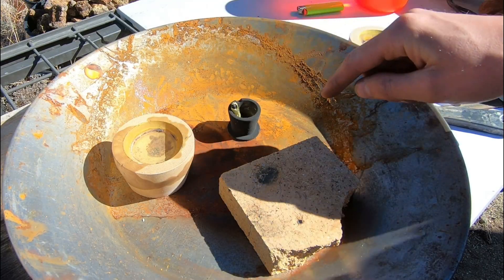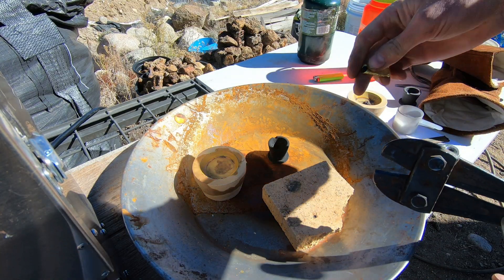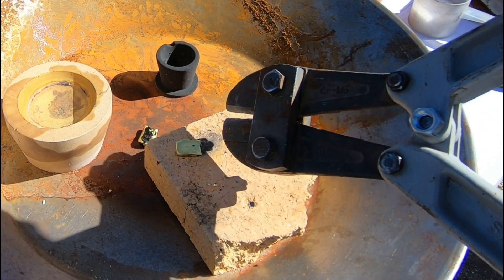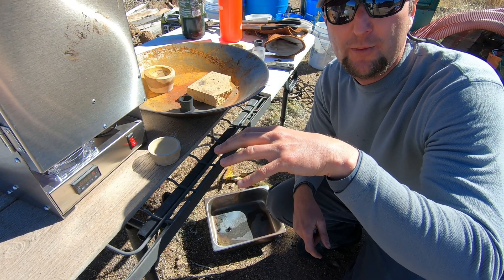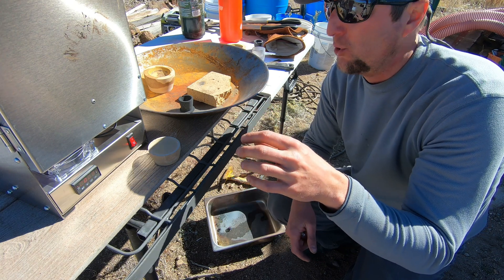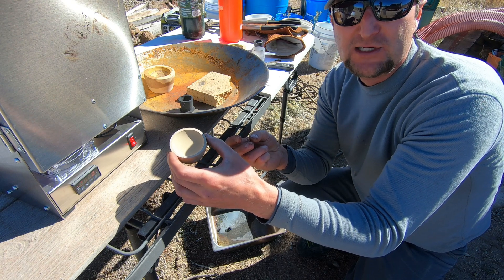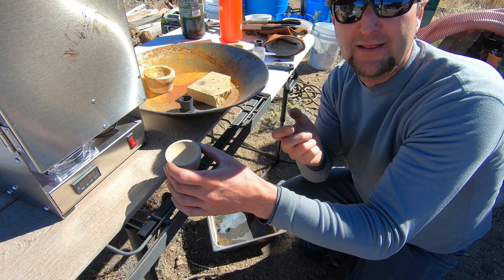It's too long — it doesn't fit. I'm going to take some bolt cutters and chop it in half. It's not very pure, so I'm doing a whole bunch of experiments with pouring and melting gold today — trying crucibles with flux, without flux, pouring. The gold is somewhat still impure so it's not pouring beautifully. Now I'm going to put the gold in a cupel with a little bit of lead to see if we can pull some of those oxides and impurities out, and potentially end up with a nice round bead that might look better than the bar.